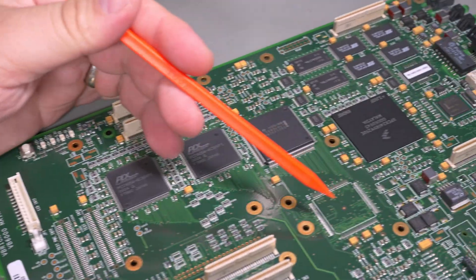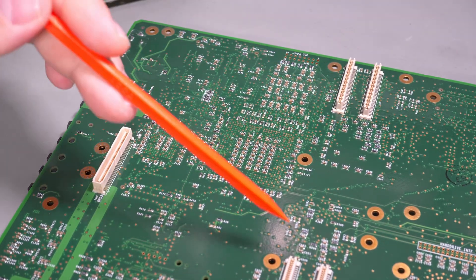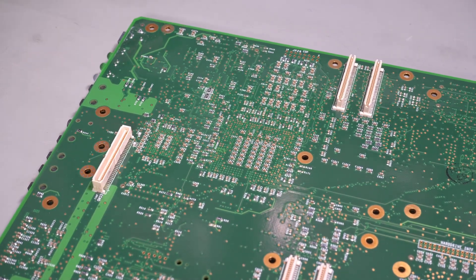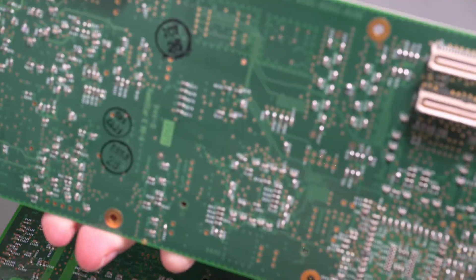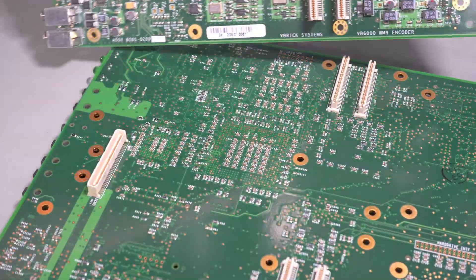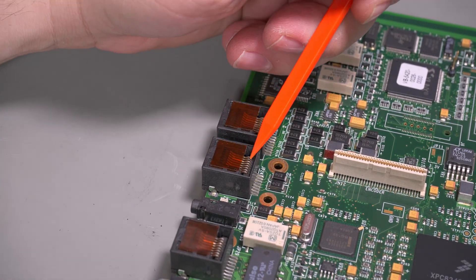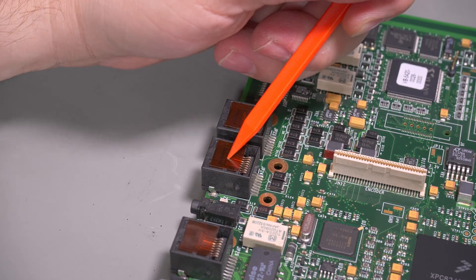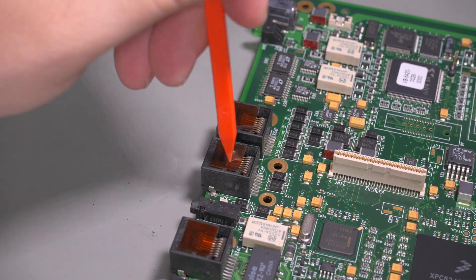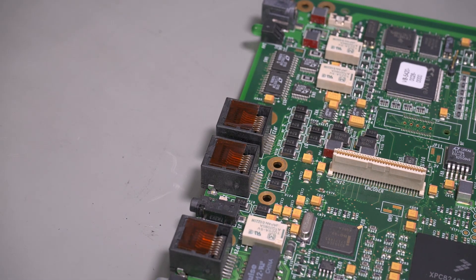In the back it's all bypassing, but there are some more high-speed connectors. I assume there's another model where you can stack boards underneath, because these boards don't actually match up — they're horizontal connectors, but the ones on top almost match up. Must be another model. Little side note: if you ever see connectors with little bits of Kapton tape on them, this is because they're surface mount and it allows the pick-and-place machine to grab onto it with a vacuum picker.